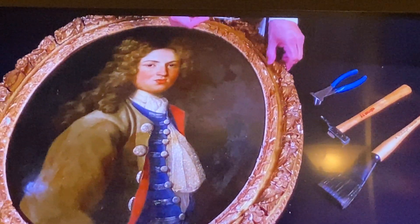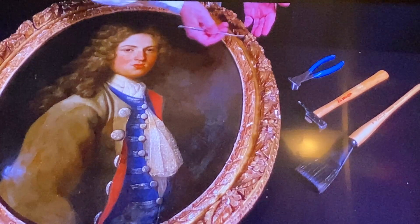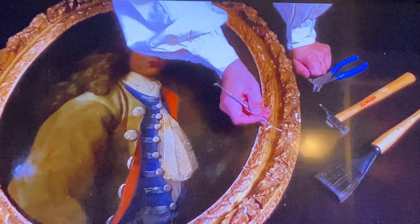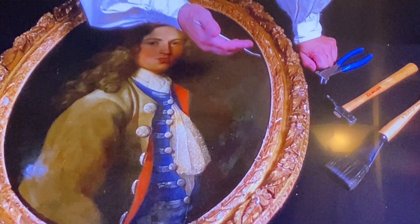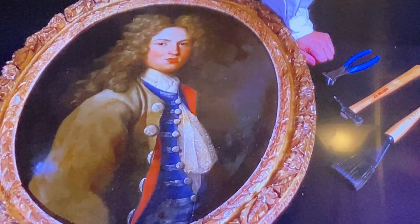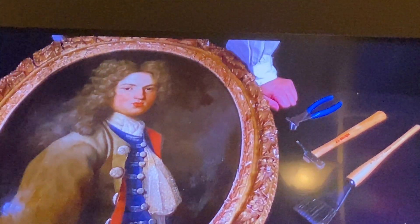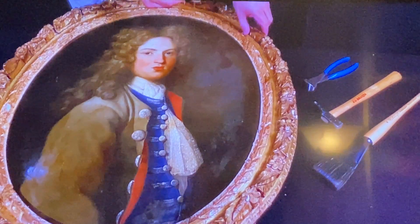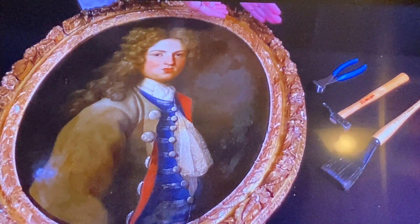As we talked before, these were carved wood segments placed on the initial frame. A lot of them have lost petals of flowers, which I'm going to replace. There are various losses — someone has come back and put gold or paint over them to hide the losses. We're going to try to take this back as far as we can to what is original. Some of these have been recast in English Paste, which is essentially a variation of gesso. They took the easy way out — maybe they didn't have the skill to do hand carving. These will be replaced. Some have come off and been re-glued askew — those will be popped off and put back in a straight line.